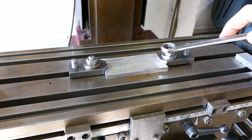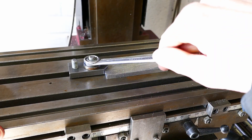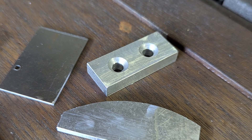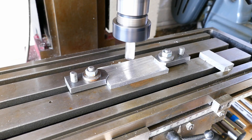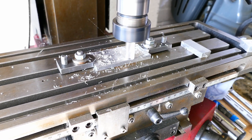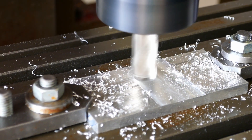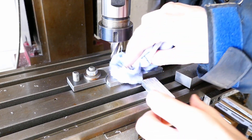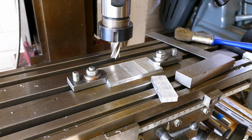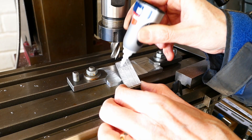The second example is a fixture on the mill table. This is a different approach where a larger fixture is clamped to the mill table. The work piece is a thicker aluminium block that needs to be squared and have two countersunk holes machined into it. In this case the fixture is sacrificial as it will be cut into by the mill and the drill. For this example the fixture previously used now becomes the work piece, so already has the grooves machined into its bottom surface; otherwise the new fixture would need to be grooved before gluing the two together.